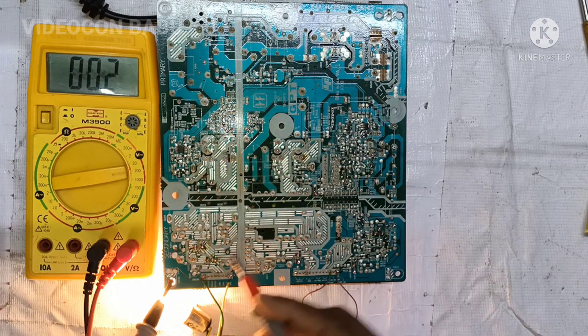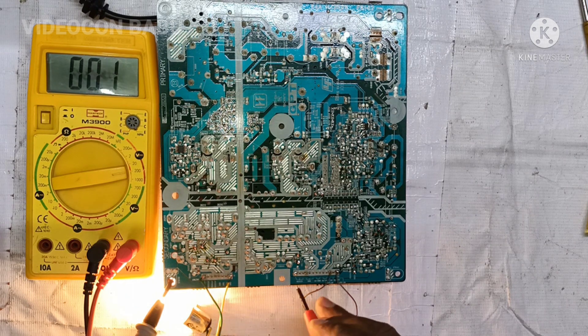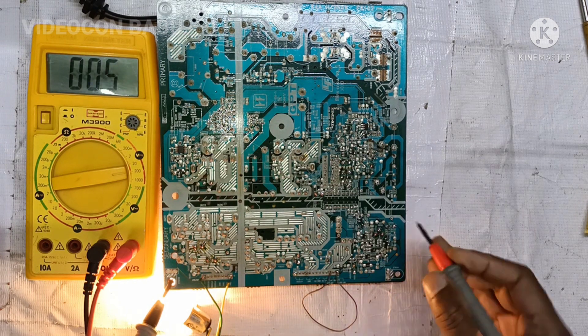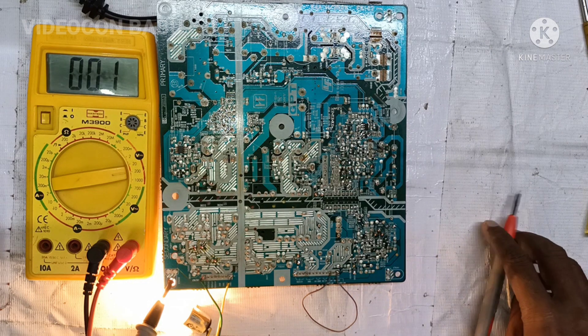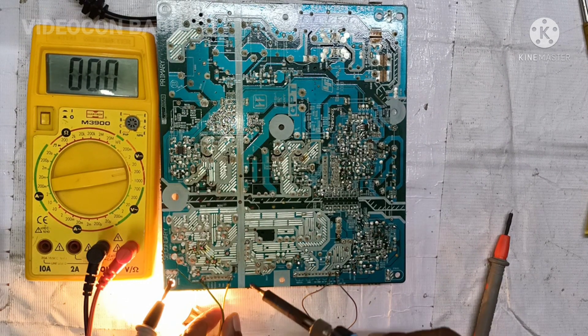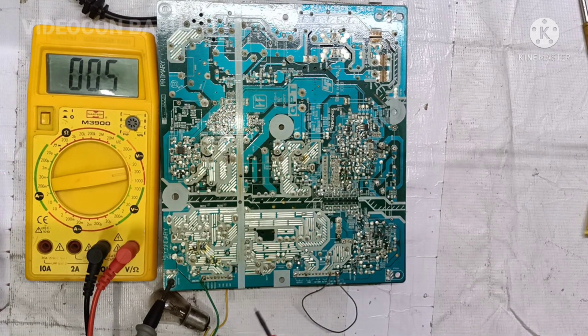The ampere level is good with no variation, but the voltage gets loaded down to about 19.9 volt. So the error amplifier has a problem — the regulated 12 volt also gets reduced, and the audio power also gets reduced. The voltage, which should be about 15 volts, reduces to 12.7 volt. So the error section has a problem.